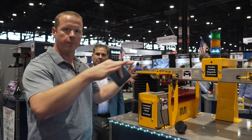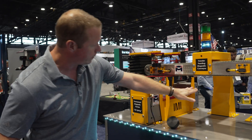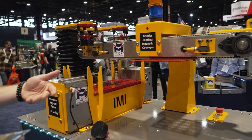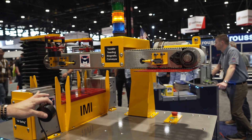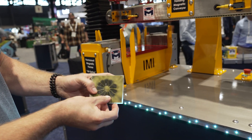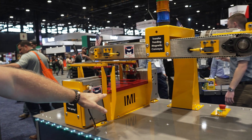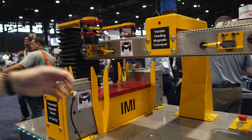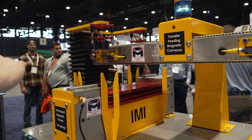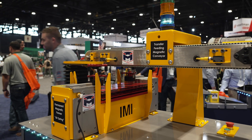This kind of showcases some of all of our technology put together. We have two magnetic fanners on each side of the stack here. That levitates the stacks up to make sure we're not grabbing two sheets at a time. The magnets on here are a de-stacking circuit, meaning they have a shallow magnetic field — they don't reach out very far to draw metal in so they won't grab two sheets. They'll come all the way back up and they'll only grab one sheet. If they were grabbing two sheets, the fanners would separate those apart, and then it brings it up to the magnetic conveyor and takes the part on to where it needs to go.